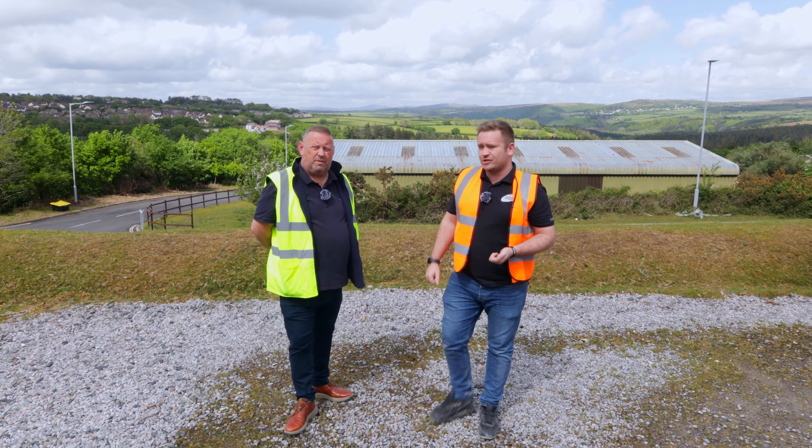This marker line is for the items we use on the lighting panel. We've got a basic PVC extruder. We use PVC compound and put a pigment in it — what we call a master batch — to get the colour. This is brown, so we're doing a brown marker at the moment, which is number one. It's a combination of heat and pressure pushing the molten plastic through the tool, and we've got a tool there that forms the actual shape that we want.